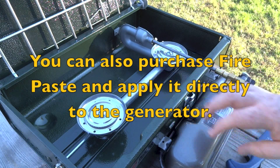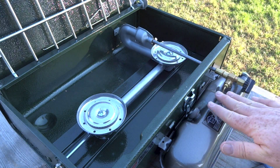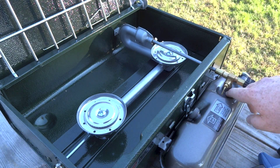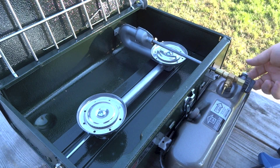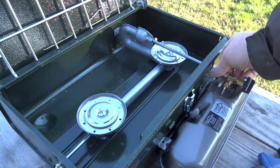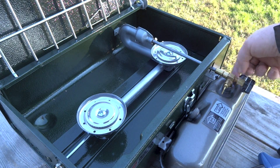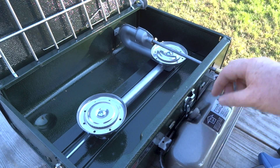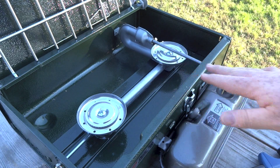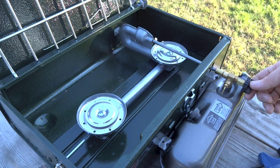We're getting ready to light it. It's very important that you don't rush into this — pump it up and let it sit for a couple minutes. Check visually and physically to make sure there's no fuel leaking. If there's fuel leaking, that's a big problem — you need to tighten up the appropriate bolts or examine the appropriate gaskets and get those leaks fixed before you operate the stove, or you could be in big trouble.